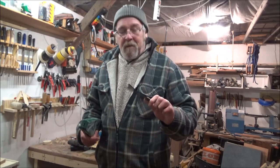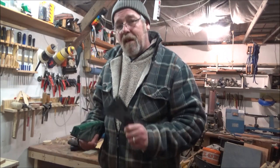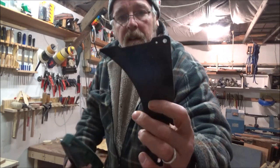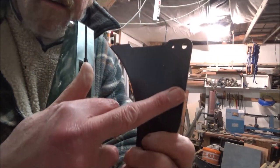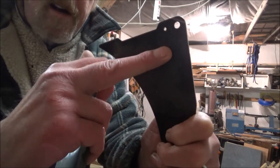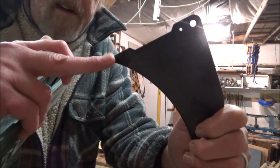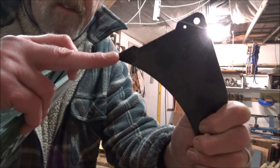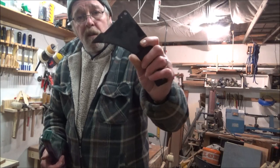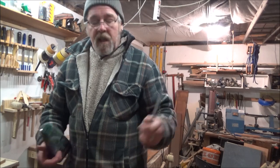But on this particular occasion, I didn't have it on because I'd been using my sledge. And the problem with this riving knife on this saw is, I don't know whether you can see numbers on there, but that's the blade height, and that's how high the riving knife comes above the blade, because it's mounted like that. So my blade height's about there, and the riving knife comes above it. So if you've got the sledge on and you needed to do a deep cut, it won't work because the riving knife's higher than the slot in the sledge.